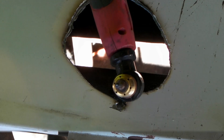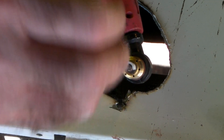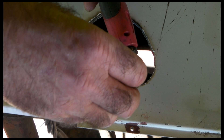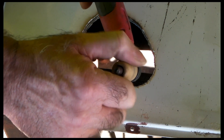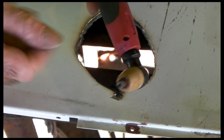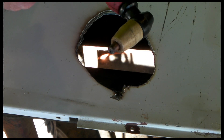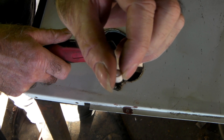So now we're going to do another cut, but what I'm going to do is put a damaged swirl ring in it. I'll put a half a swirl ring in there, just like it's damaged - it'll still hold the electrode out, simulating that it's got a crack in it. It's very hard to put one back in that's been smashed. So we'll put the electrode on like that, then I'll put the ceramic cup on the top, screw them up tight. This is just simulating that we have a swirl ring with a big crack in it. Let's see how it cuts.